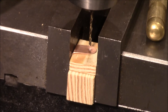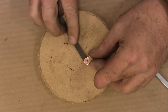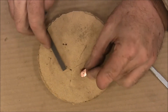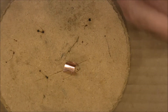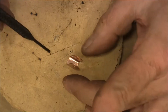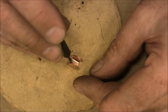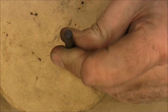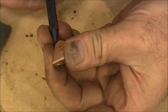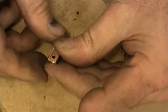I did a little punch mark there so I could see it better. After drilling it out, I've got a little bit of a burr on the inside that I want to knock off. Now I need to put a little hole in the bottom to put a screw in later. I could have done that before I folded it, but I'm going to use this squared-off punch here, set it kind of towards the back, and give it a hit. And that punches out a hole.